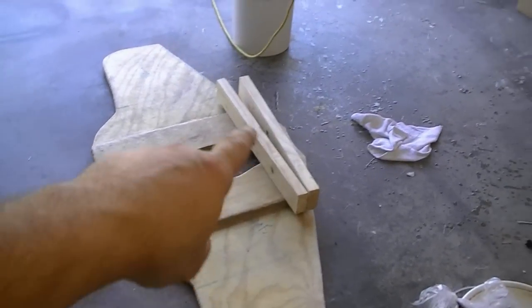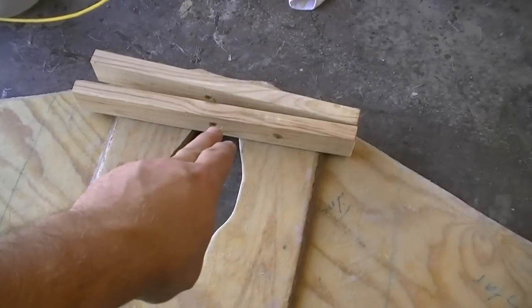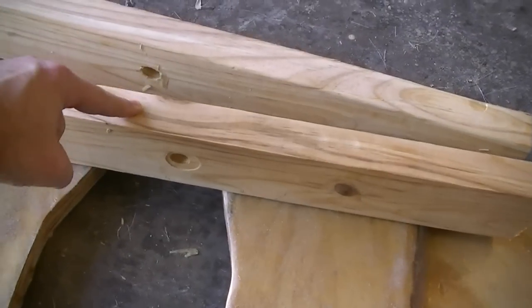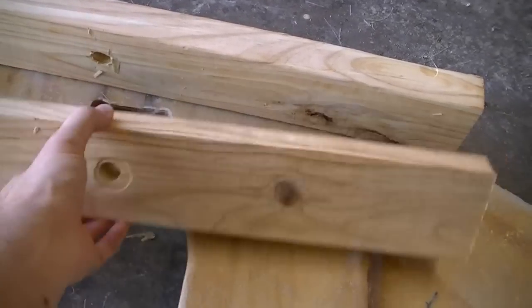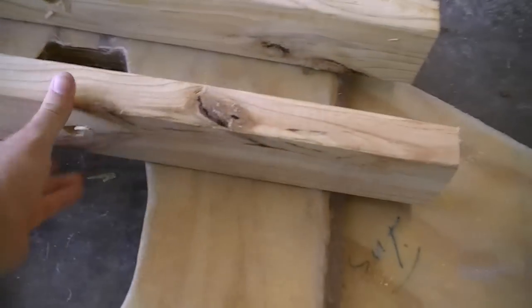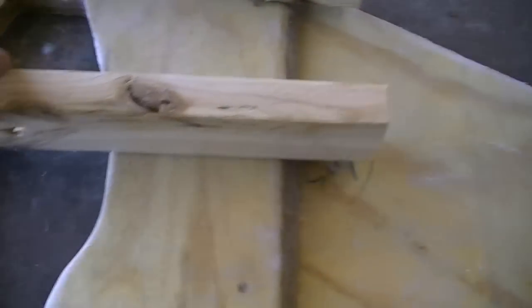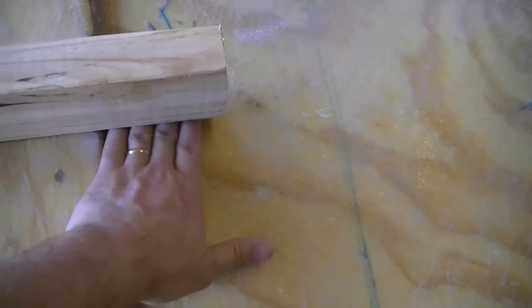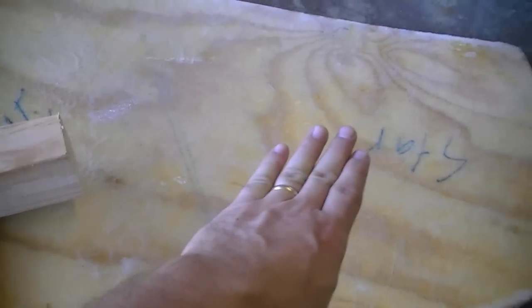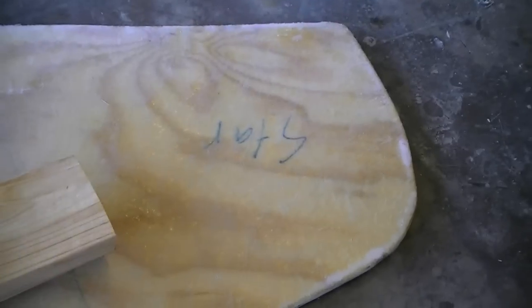That means I've got to do a lot of planning — I've got to really plan my clamping. What I'm doing is laying out my clamping right now. I'm going to have a short one on the bottom standing on end, and I'm going to re-cut this because it'll be weak here, then drill another hole all the way through on both sides. You want to clamp this way because it gives you more clamping power over a longer distance — that's the way 2x4s have their strength. As they go out longer and longer, I'm going to add pads to give clamping power to the outside edge to push it down.